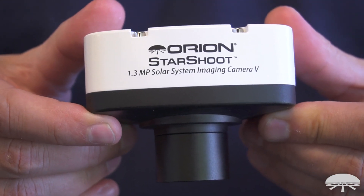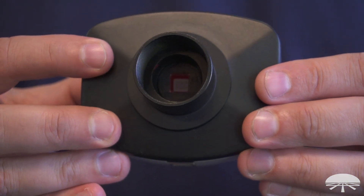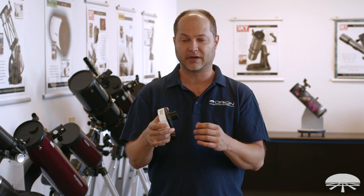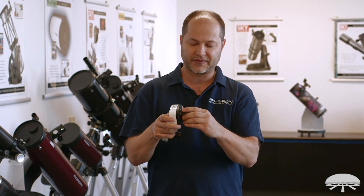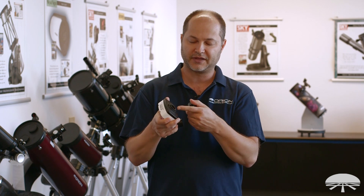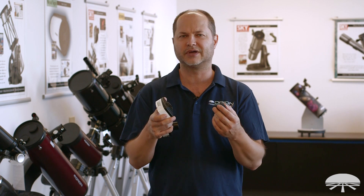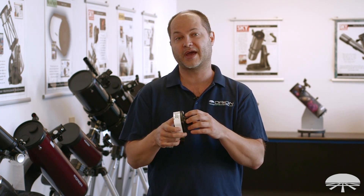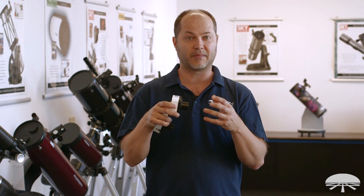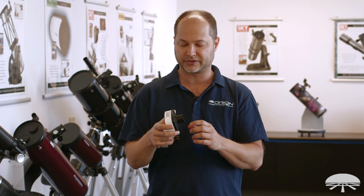Let me tell you about the mechanics of the cameras themselves. They're both identical in terms of the body shape — an inch and a quarter nozzle, so it'll slip into your focuser or a two inch focuser with an inch and a quarter step down. If you unthread the nozzle, underneath you'll find a C-mount thread, standard C-mount, which is kind of a security camera mount. Microscopes use that as well, so if you have a microscope with a C-mount attachment, you can actually use this for some microscope imaging. Otherwise it comes with the inch and a quarter adapter — slip it right into your focuser.